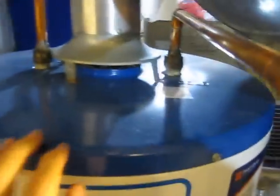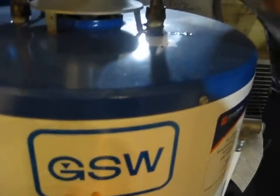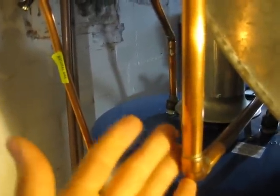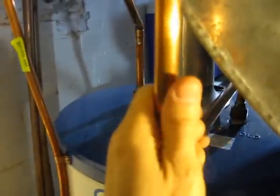And where it's going to come from is in the tank where we have solar water that's heated or natural gas heated water. And this is the pipe that goes to the solar tank right here. So it's going to be pulling that water out of the solar tank and into the natural gas tank and then up to the taps. So if you never use your tap, then you're never going to be pulling hot water from the solar tank. And in fact, that's the only time the solar heated water will go into this natural gas tank, is when you open the tap.